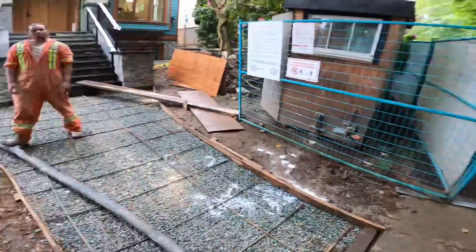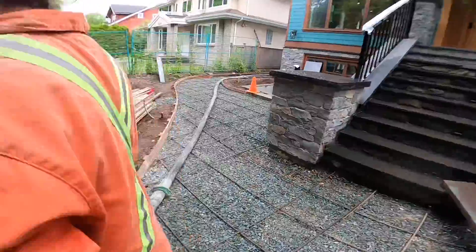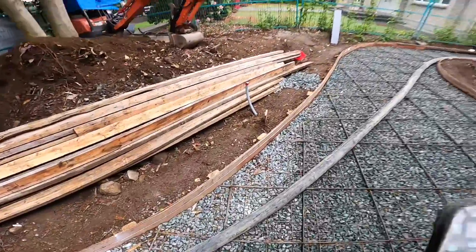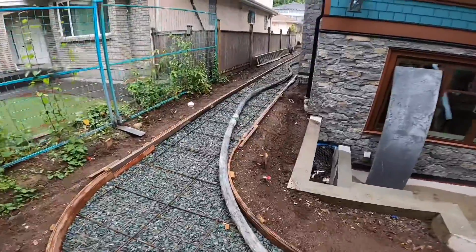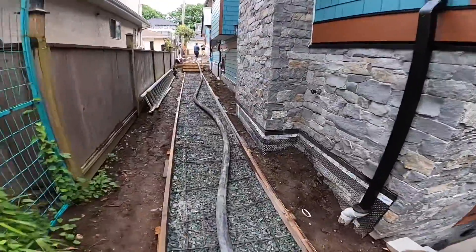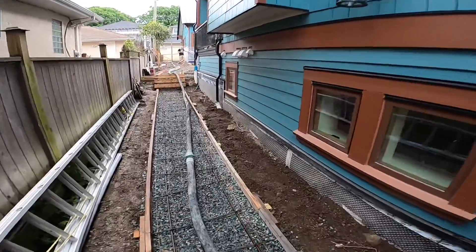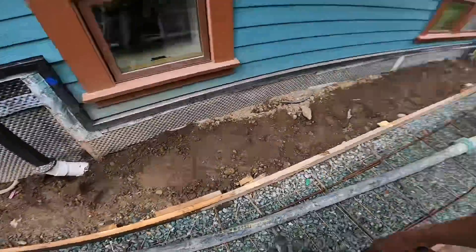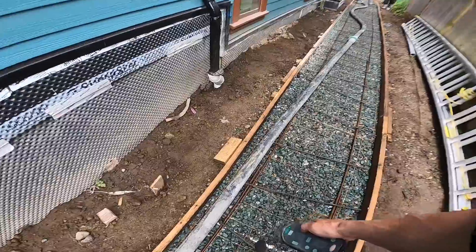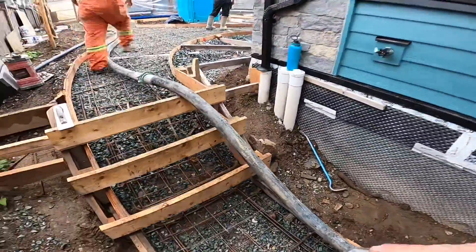Normally I would catch the stuff in buckets, but Ian says we have room on the ground to spread it, so we're just going to spread the bentonite on the ground. Two-and-a-half inch hose today — normally we would use two-inch line, but this is not a regular supplier. Given that we don't work with them that much, I just use two-and-a-half just to be on the safe side — no problems. I just slowed it down a little bit; it was getting a little bit crunchy in the hose back there.